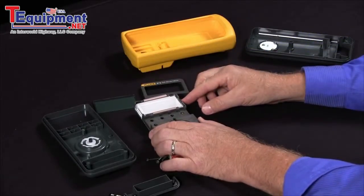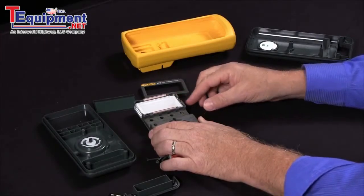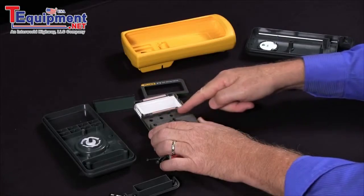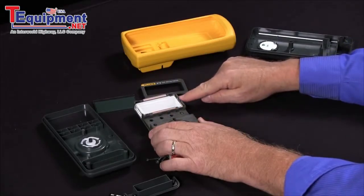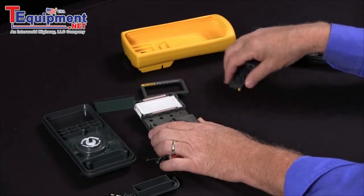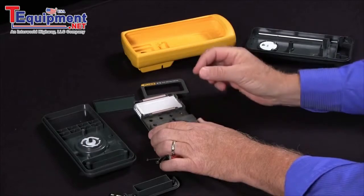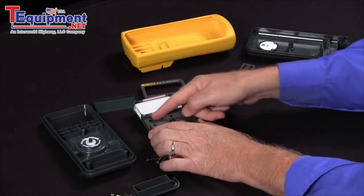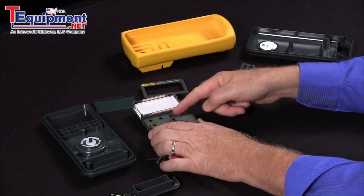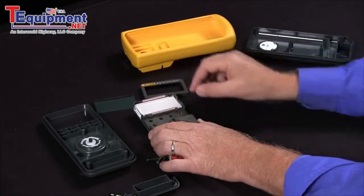If you have an older 87 — maybe one of the original 87s, because Fluke meters tend to last 20 years or more — that'll have a rubber strip along the bottom and there'll be four snaps, two on each side. You have to be very careful removing them because they are plastic. Then just remove the elastomer strip and clean the contacts with a non-abrasive eraser or a little bit of alcohol on the circuit board, then snap it back together.